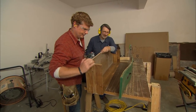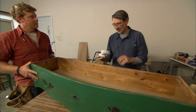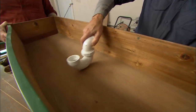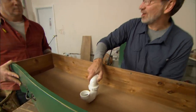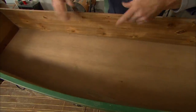Now the issue with the bottom drawer is that the trap for the sink plumbing is already in the wall, and when installed it's actually going to be lower than the bottom of this drawer — sitting right about here. So the drawer won't open at all. What we're going to do is make a trough: cut 12 inches out of the center and create two small drawers on each side of a runway for the trap.